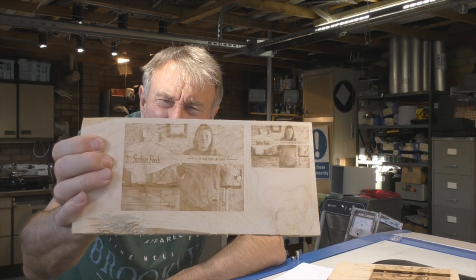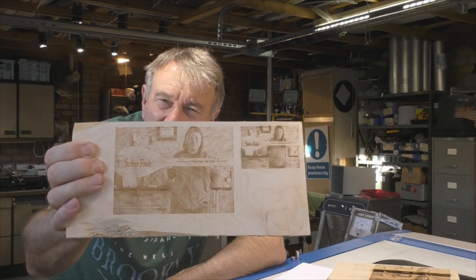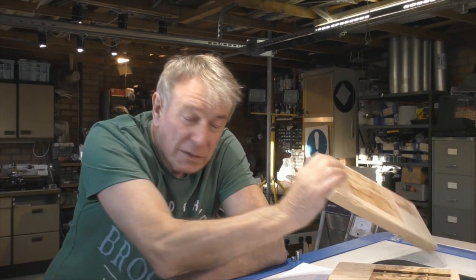We started looking at whether or not we were getting true bitmap engraving. To get a photograph like that onto a piece of wood, you can't do it with grayscale engraving — you have to use dithered engraving, which means breaking the photograph down into millions of little dots and burning each dot onto the surface one at a time. You're familiar with the technology from newspaper photographs, but doing the same thing with a laser machine is quite a lot more complex than I realized.